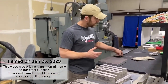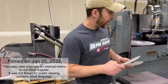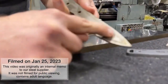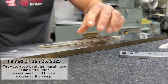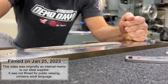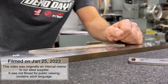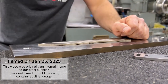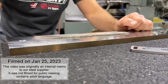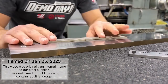I've been working through this. These thinner parts are going to be scrapped. They're really bowed, and they're bowed in really random ways. You see this really heavy decarb right here? Not much there. Because of the random nature of the decarburization, they don't want to temper flatten. They don't torch flatten. It's evidenced by all the work that the people at Peter's Heat Treat tried putting into these to get them flat. They're still not flat because there's not carbon in a lot of areas. I need to get through all of that and get a normalized parallel surface and then see if I can flatten it.